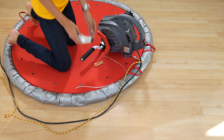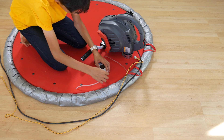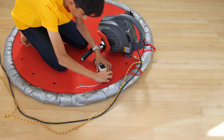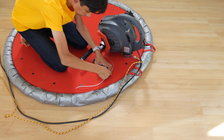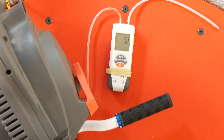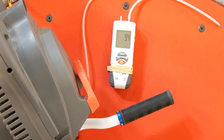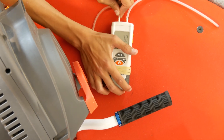I've also installed a manometer on the hovercraft. It measures the pressure differentials between its two ports. There are two thin pressure hoses: one connected to the inside of the inflatable skirt and one connected to the area under the platform. With this setup we can measure the overpressure under the platform compared to surrounding air — it's that overpressure that actually does the work of lifting the platform. You can also measure the overpressure in the skirt compared to outside pressure, and the pressure difference between the skirt and the space under the platform.